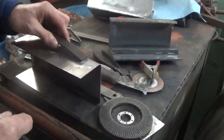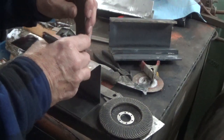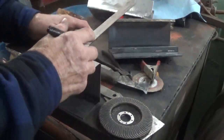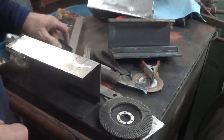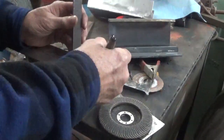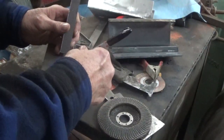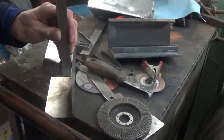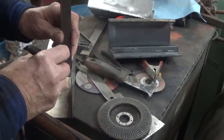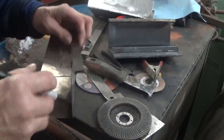I measured back in there a little bit, and then you want to turn this key on a bit of an angle, because from the points when it turns, that's how big you actually need this thing. So we're about that size. Yeah, we figure that, and then from the top. From the bottom of the top, so in other words, you have to pull away a little bit from here, which is probably about right there. Okay, and then do the same thing on an angle from this corner to the opposite diagonal corner. Okay, and that's basically where that square has to be.